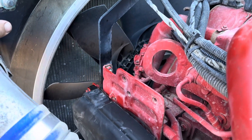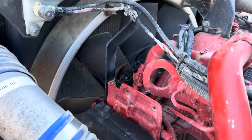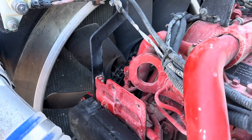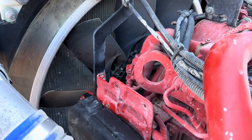When it does come down to actually having excessive crankcase pressure out of your blow-by — when you pull your oil cap — then you're going to be looking at some bigger issues with your engine. But as far as the crankcase pressure code, this is a pretty affordable and easy way to try and solve that.